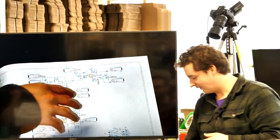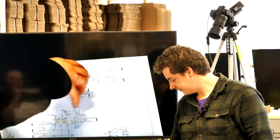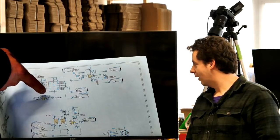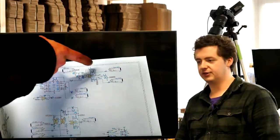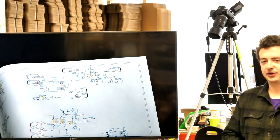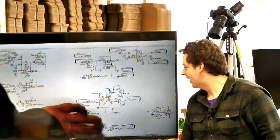Say you had a low-frequency sine wave mixed in: at the comparator input you'd see the square wave superimposed on that sine wave, and because the op-amp squares it off again, biasing the input shifts the pulse width. It's a neat transform — what comes out isn't obvious from looking at the input on a scope, but you can hear the effect clearly. We then switch between the sawtooth output and the pulse wave via the shape switch, feed it through another capacitor to remove any remaining DC offset, and that gives us a variable bipolar signal from that pot.